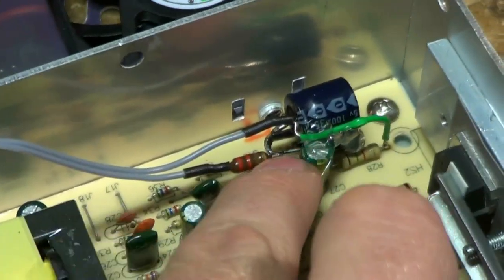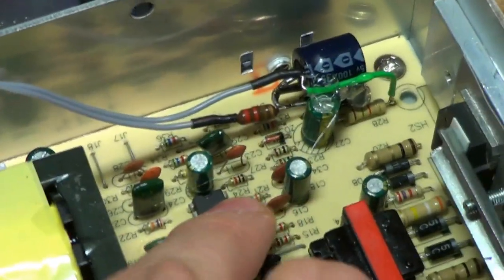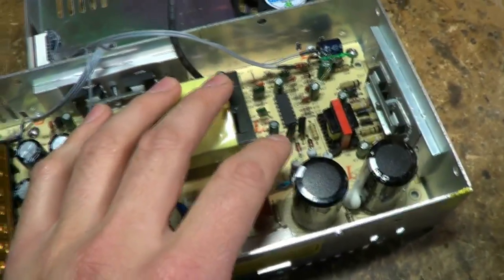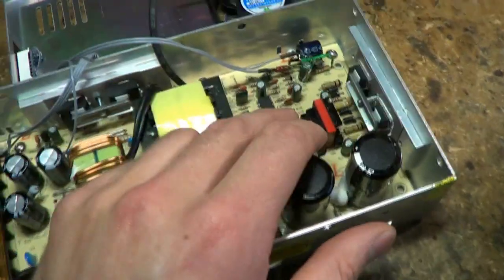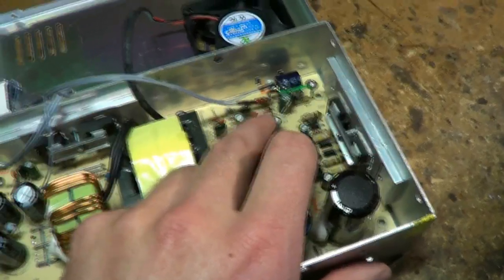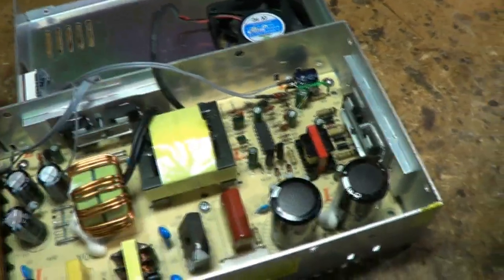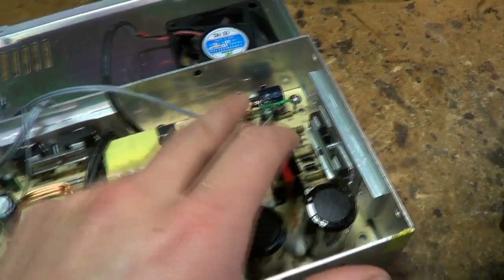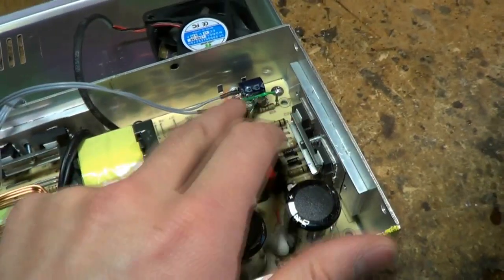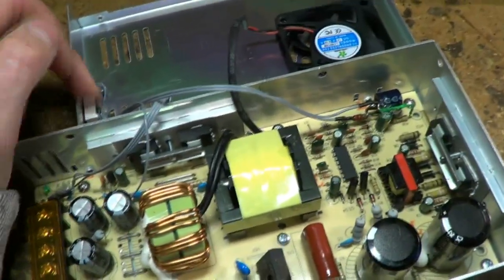This is powered off an additional power supply. Full reasons for this are given on the website. Basically when the whole supply is unloaded or operating at very low load, the supply goes into a sort of self-excited mode and the auxiliary supply voltage becomes a little bit unstable. I found this was causing problems with the voltmeter module, so I added a completely separate supply. It's still derived from the transformer windings but completely separate from the auxiliary supply used for the TL494. That gives you a nice smooth supply for the voltmeter module.